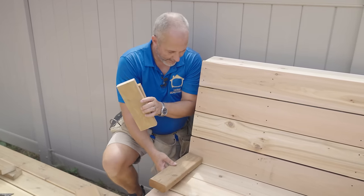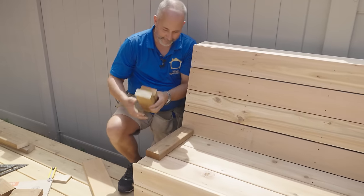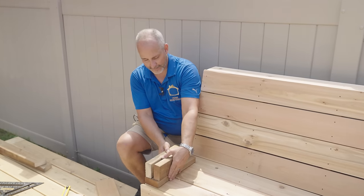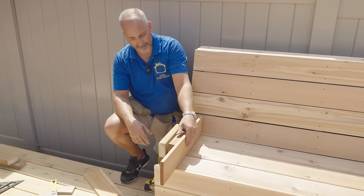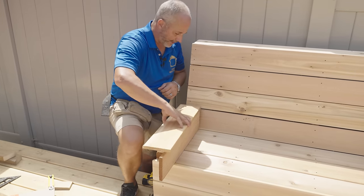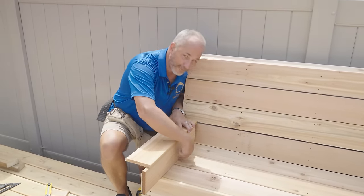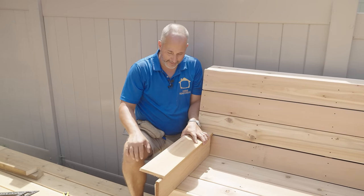Basically, I'm gonna put a 2x4 right here, and then 2x4 is like this, right out to the front, okay? And then I'm gonna clad it in cedar, wrap it around, put a top cap on it, make an armrest. Not bad. That gives me 46 to the inside finished. And puts somewhere to put a drink on this other end of the bench.